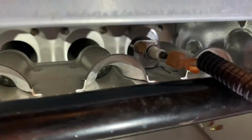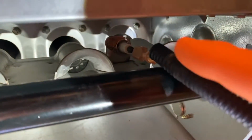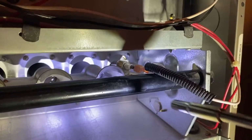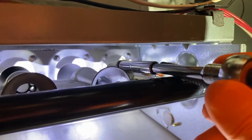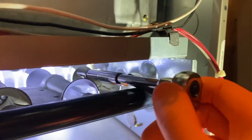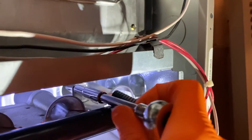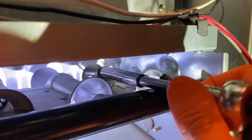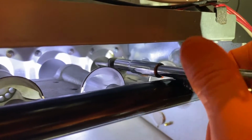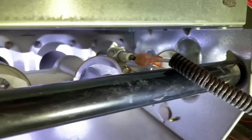And inside there, you have a 1/4-inch screw. Go ahead and unscrew that. And by doing that, you can carefully shift your flame sensor out of where it secures itself to. Again, a 1/4-inch screw way in there. I've got an extension, small socket, and ratchet. And as you loosen this screw, just do your best not to harm any additional parts or wiring. And do your best not to drop that small little screw when it comes out of the securing plate inside there. And it looks like it's out.